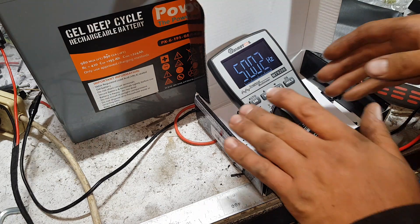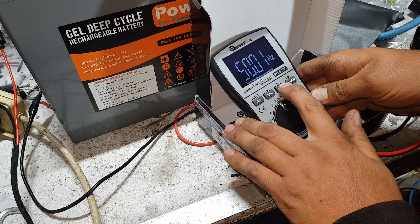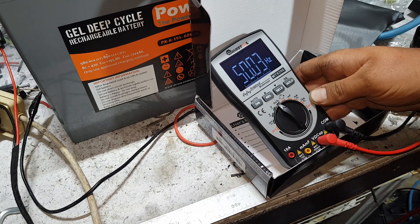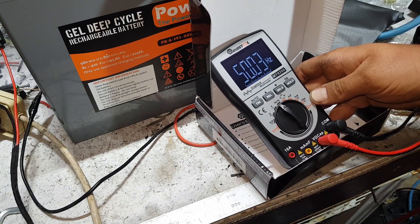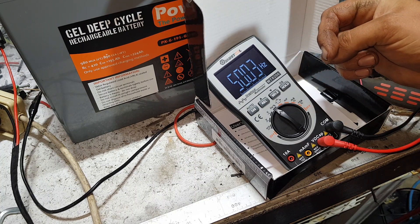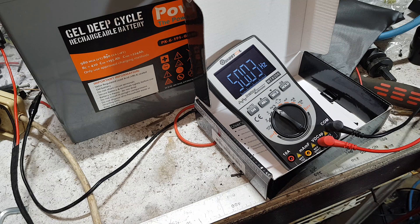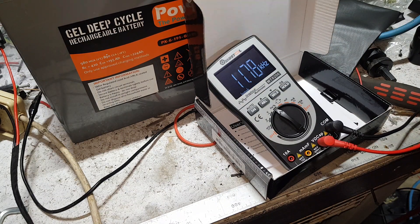How do we change the display to a graph? You can change it to show the percentage of time that it's actually on. So if you had something that was pulse-width modulated — for instance, which we'll try with my charge controller tomorrow — it'll tell you the percentage of duty cycle it's actually testing. That's them safely unplugged.